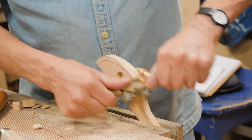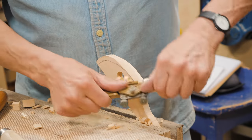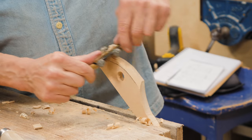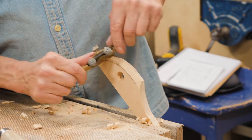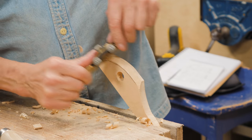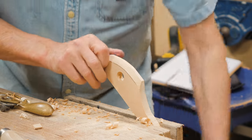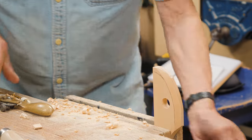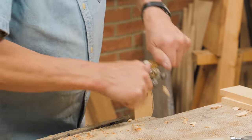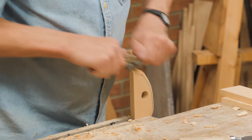We're just putting a bevel on here now. This is beech wood, and beech wood is very traditional for cooking utensils. I put the bevel on, I come around this corner now, follow the bend, and I'm working to my line, like this. Now up here, you're going to find that's going to break away if you're not careful, so it's better to come upwards like this. Like that. So we've no breakout on this edge.